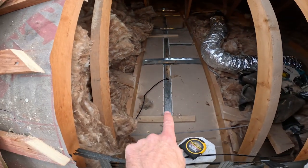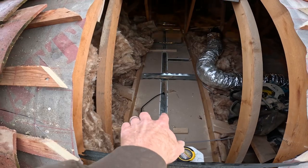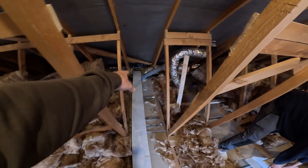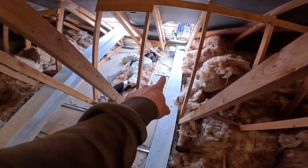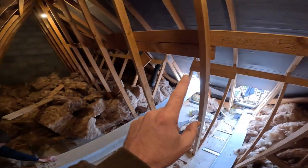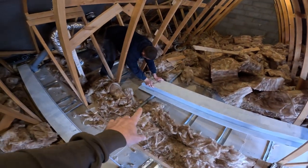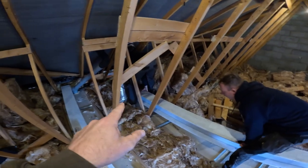So on this one, that's our stair wall. Our stairs are going to go on that side tight, so we need to make sure our steel is set out lovely along that edge. First one is in. We've got a bearing plate front and back which it's sat on. Then we've got this other one going through here - I've just re-shifted the chain so now it will start rolling, and we're going to slide it through.